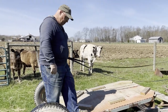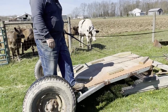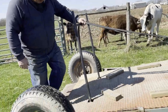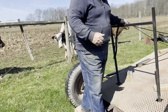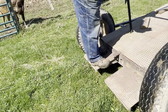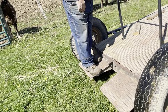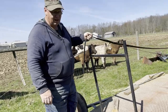The only other thing I would add is some safety in here. My foot doesn't go through, but I'm afraid of a child getting his leg down in there, so that's going to change. These bumpers — when you're going through the woods and get up against a tree, it pushes you over, and we have a few spots where they definitely made all the difference because it would be pretty easy to get stuck. The steps in the back are not necessary, but what I found out by accident was if you start to make ruts — which we only had two places — these steps actually help flatten them back out. A guy could probably add a V with steel underneath, four or five inches, tucked up out of the way, so that V would fill the ruts in as the center of the road got high. For the first time out of the box, we're pretty satisfied that it worked good for us.